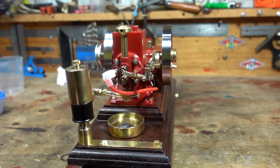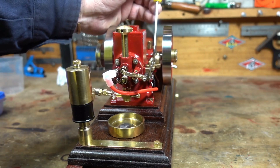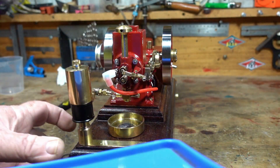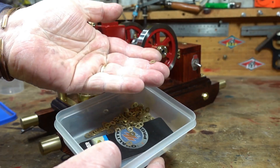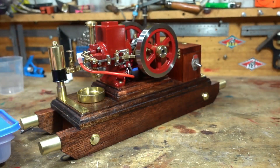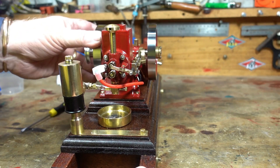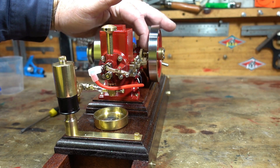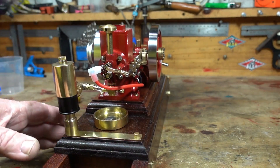I'm not sure if you might be able to see in here — let me get a screwdriver. Can you see the governor, the two Governor Weights in here? They're a little bit proud from that toothed wheel now. What Henry said to do was put two brass washers in — I've got some one-eighth brass washers — one each in behind each weight. The idea Henry said is to stop them suction-fitting with oil onto that wheel, and it just gives them that bit of freedom to flick back and forth like they're supposed to.